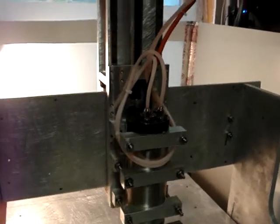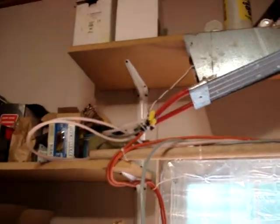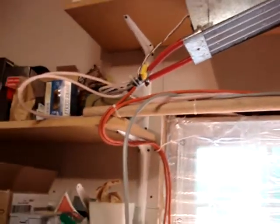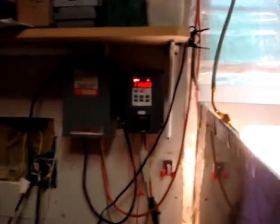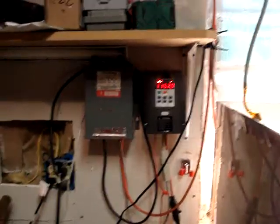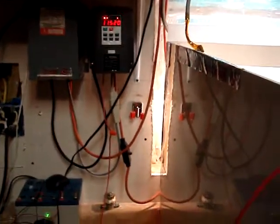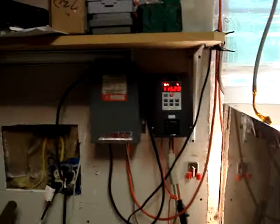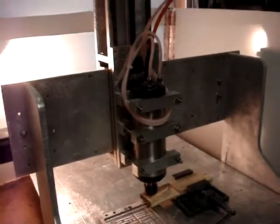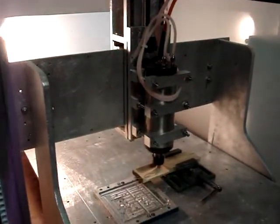So this spindle needs water cooling. I've got my water lines running up there where I have a pump mounted and a little radiator. There's a little magnet driven gear pump — a nice little 110 volt thing. My spindle needs 220, so I went ahead and just stepped it up with a 1 kVA transformer, getting 115 to 220. For safety, I made it so that whenever I plug in that transformer and provide power to the spindle, the pump will automatically get power, so I should never have a case where I could run the spindle without water cooling.